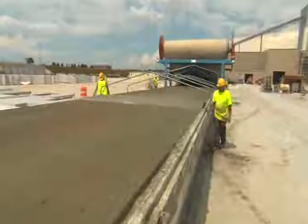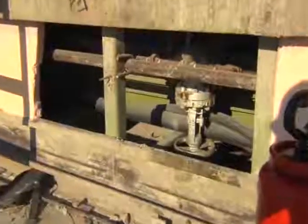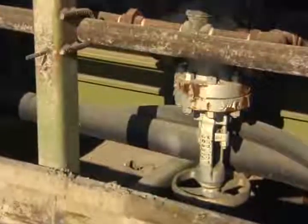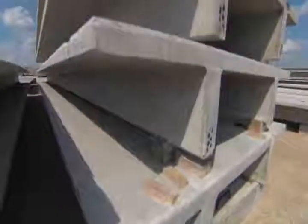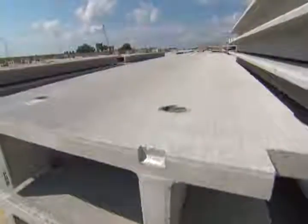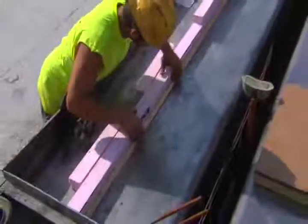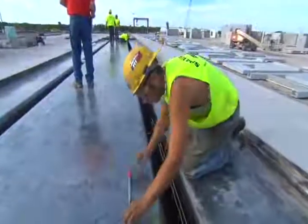The bed is now in its curing stage. Sometimes, particularly in cold climates, the double T may be covered with tarps; in other areas they may be open. Accelerated curing is often done using live steam or radiant heat from heaters attached to the form itself. Double T's for parking garages really need to be held to a high standard. When they're assembled in a garage, they make the finished surface, and there are tolerances for putting these pieces together and offsets in the surfaces. All of the connections are very sensitive, and the embedments in the double T have to be placed properly — there are a lot of critical issues you have to be concerned with to get proper performance out of that double T.